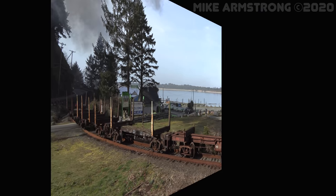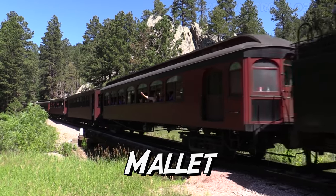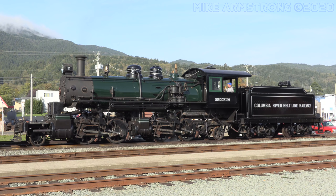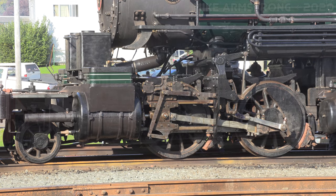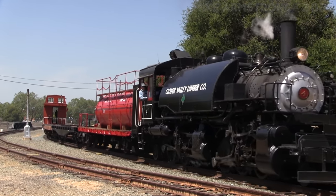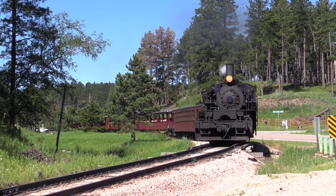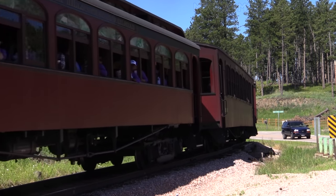Let's now discuss the major types of articulated steam locomotives. The most common design in the United States was known as the Mallet, named for its inventor Anatole Mallet. We will spend a little more time focusing on this one because it was the only articulated design to see any large-scale use in the US. Mallet locomotives have two sets of driving wheels. The rear set is attached to the main frame of the locomotive while the front set is attached to its own separate frame connected to the rest of the locomotive frame by means of a very large pin. Weight from the front section of the locomotive rests on a sliding bearing built into the front set of driving wheels. This design was ideal for building a larger, more powerful locomotive that could traverse the same stretch of track, traveling through curves with ease. Anatole Mallet's design was popular on some railroads in Europe, but it saw arguably the most use in the United States during the first half of the 1900s.